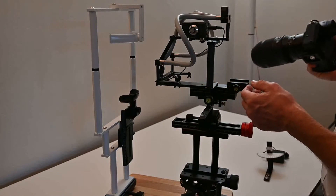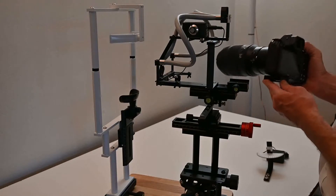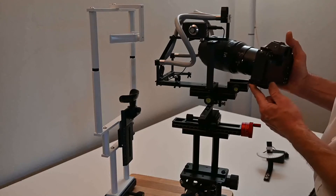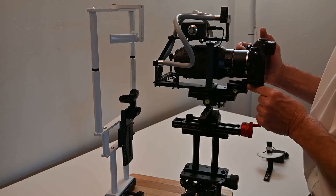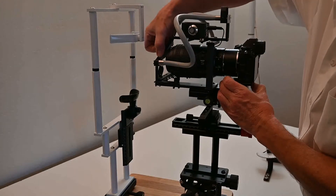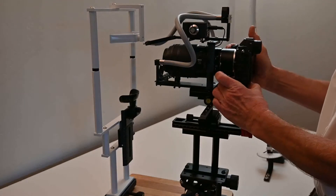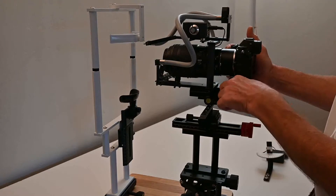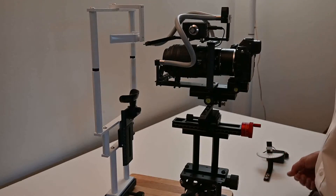The camera is attached after the illuminator because it's heavy and the illuminator is easier to do first. Rest the corner on the clamp, get the other corner in, then go forward. Up here the center light is on a hinging mechanism to make fitting easier. Torque that down nice and snug.